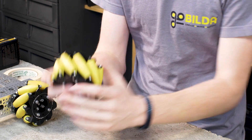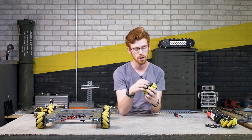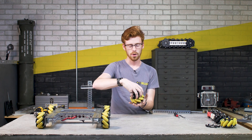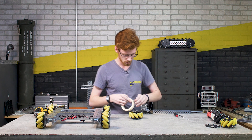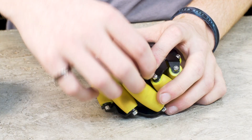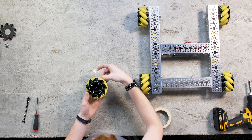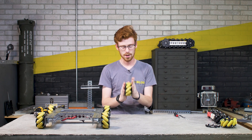Before disassembling, note that you have four on-pattern holes on a 32-millimeter grid and nine rollers — those two numbers don't play well together, so there's really only one orientation where the two plates work together. You'll want to mark that orientation. I like to use masking tape or an erasable marker. Mark one side of one plate, then on the exact reverse side mark the opposite, so you can reference those two pieces of tape and know exactly which orientation the plates need to be in.